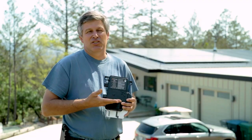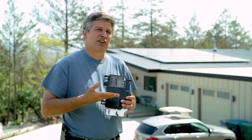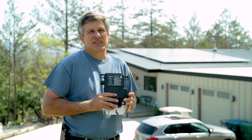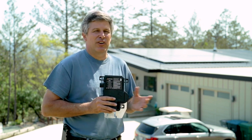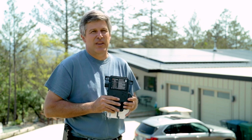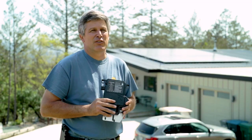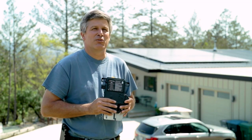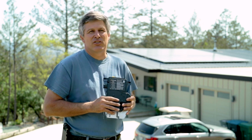With the IQ8 system, the solar itself can form its own microgrid — you're no longer dependent on the battery to form that microgrid. So if you do get into an outage situation, you can bring the system back up without having to introduce a generator or the grid. This gives a little more capability to the system and resolves some potential homeowner headaches during prolonged outages.